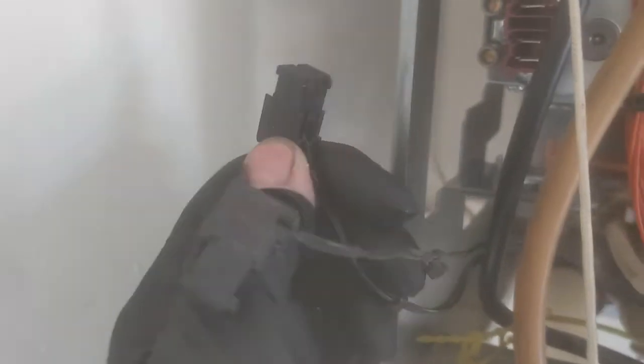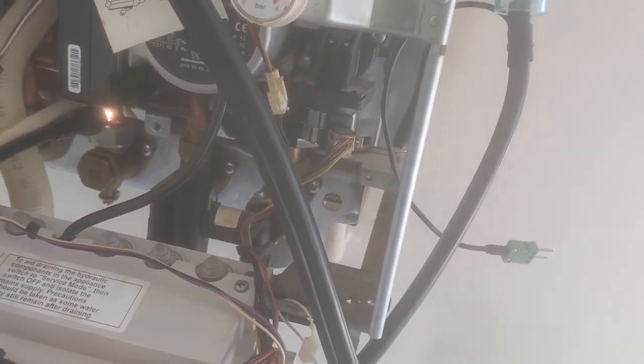So yeah, just check everything that you've done. Obviously I've not shown it, but I've nipped everything up with the spanner, tightened everything securely. And then the two electrical connectors now can be connected into that front section that's just been screwed on. With a leak detection sensor as well, all the disturbed joints will need to be checked with the burner running. Yeah, just make sure everything is gas tight.